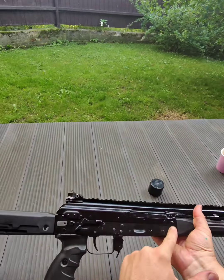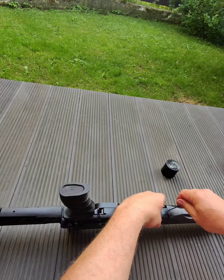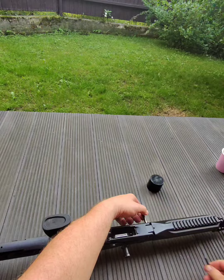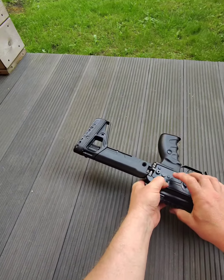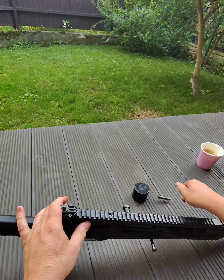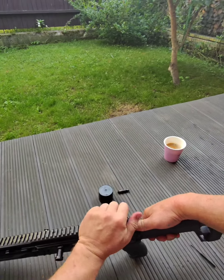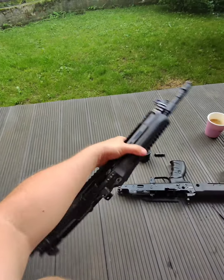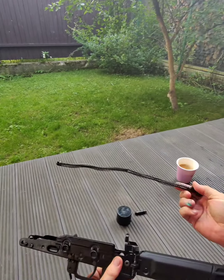This is a gun which can be disassembled to parts. To disassemble it, you have the front pin and the rear pin. To remove the front pin, push the spring of the handguard. The rear pin is made like a Sig-type — it's not captive on this R&D gun. To disassemble, push the recoil spring, and basically here's your upper and here's your lower.